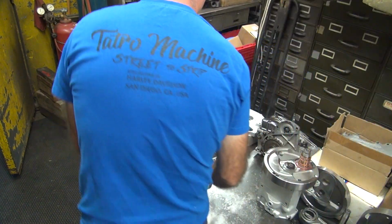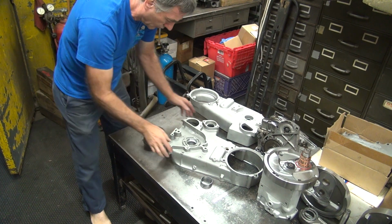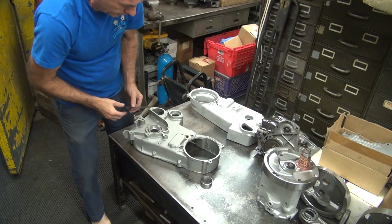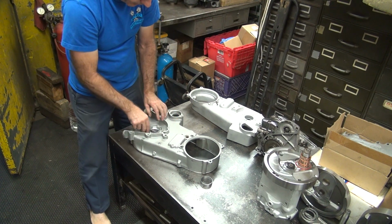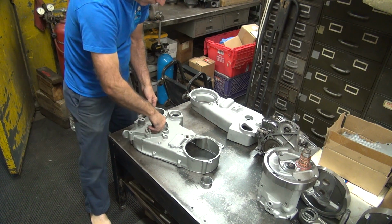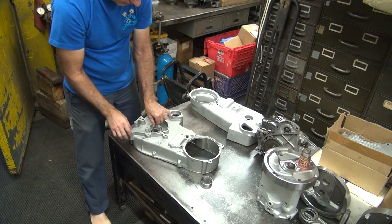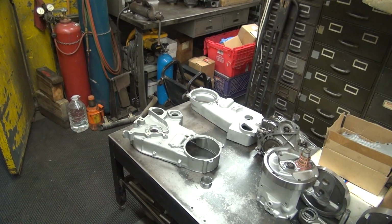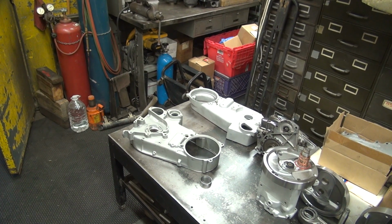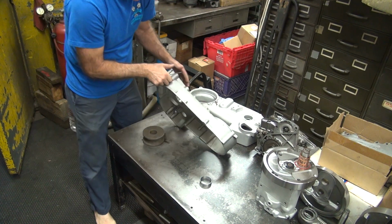We'll put a 10-thou shim underneath the pulley on this side over here and see if it levels it out. Way closer. Close enough to use. Kind of lightly touching on that one side and it's hitting hard on the other side. So I guess I could put that thought out in there. That's probably about how far off it is. Alright, put that 11-thou shim stock on that one side. It's still showing it needs that.